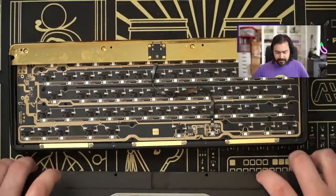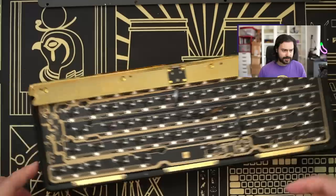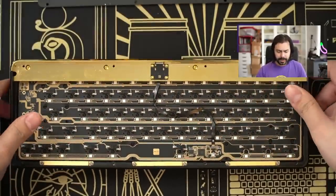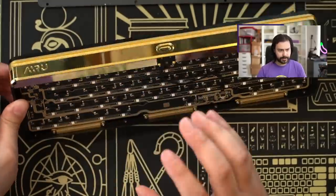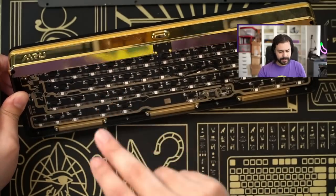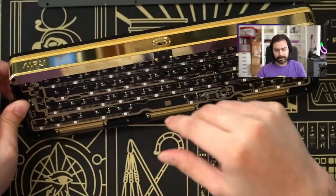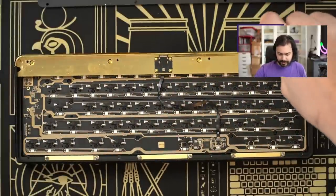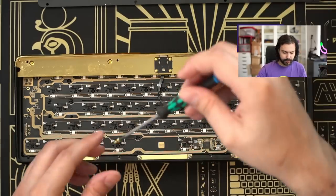Now, this is a mounting method that you've probably never seen. This is gasket, but I took the bottom off, and it's still fine. But Simon, how is it a gasket? Well, there is this piece here and these pieces here that essentially clamp to the top that sandwich the PCB plate assembly between two rubber gummy snakes. Now, let's go ahead and take it apart. This top piece is purely decorative, by the way.